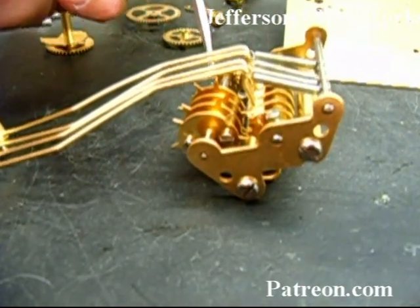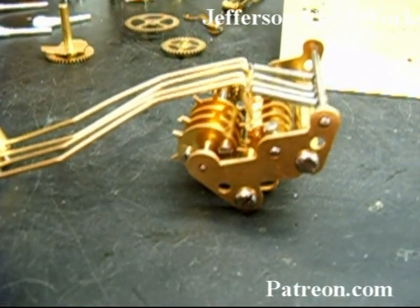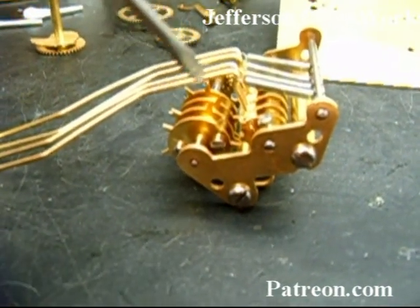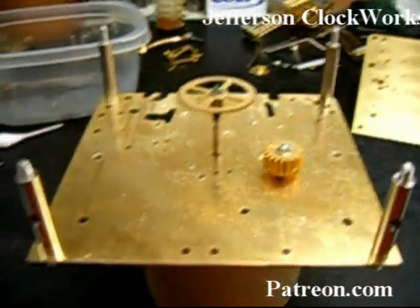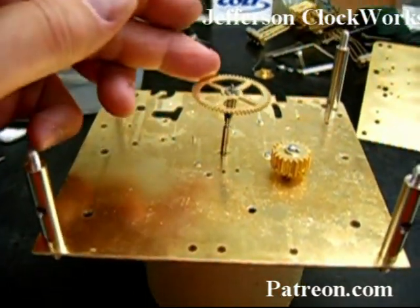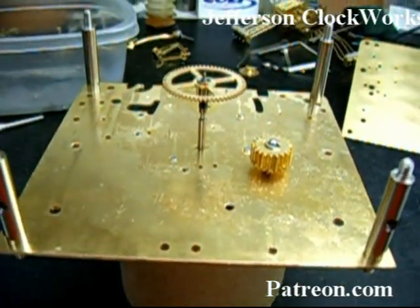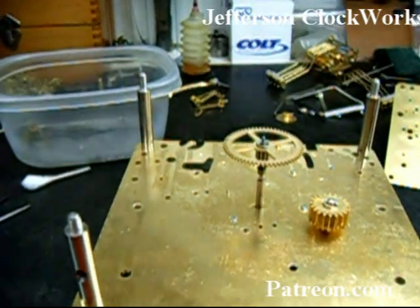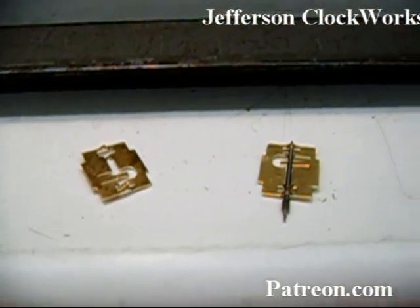I would use some synthetic grease on the face of the teeth. You can put it on one tooth on each one of the discs, and as it rotates it'll spread the grease to the appropriate areas. The idle wheels are reinstalled so they can transmit power to the rest of the chain. I've got the minute arbor lubricated and reassembled. Now I'm going to start putting in the rest of the wheels.